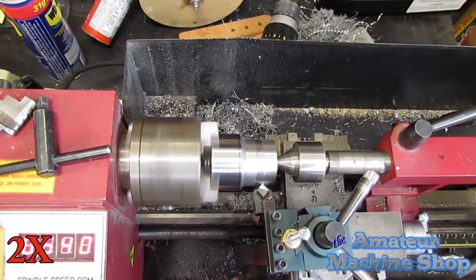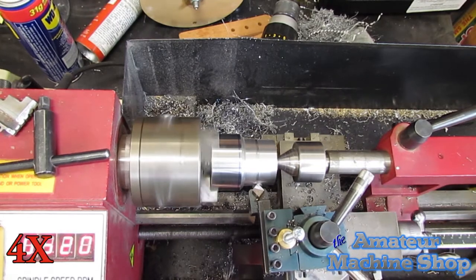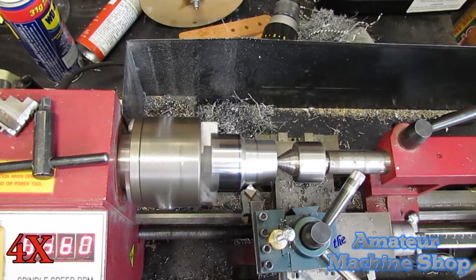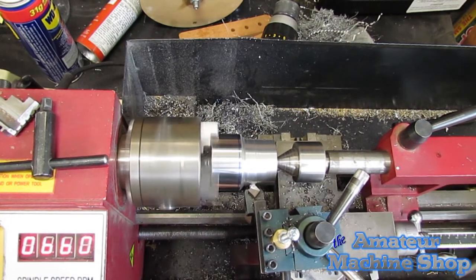Here I'm lathing a piece of 2-inch diameter 1045 precision ground shaft. Shallow cuts of about 20 thou are about all that can be taken. It machines a little more difficult than cold rolled steel. I will push the machining a little harder to find out what will happen.